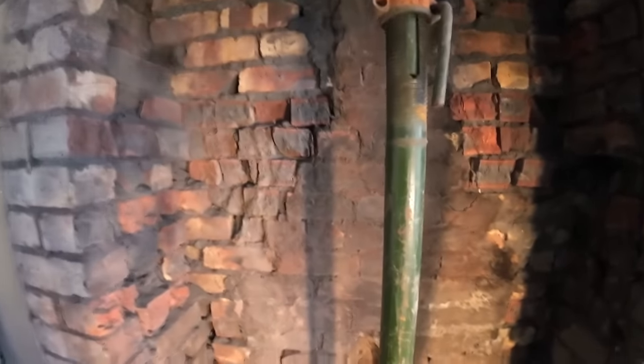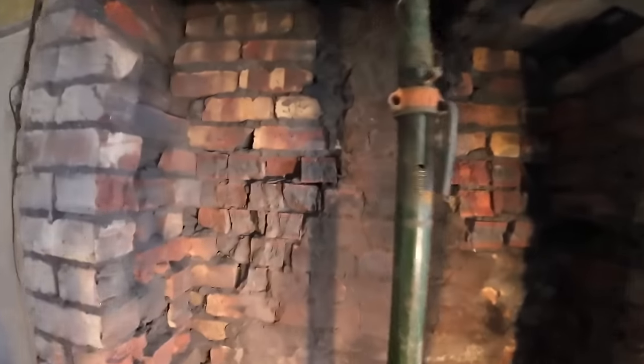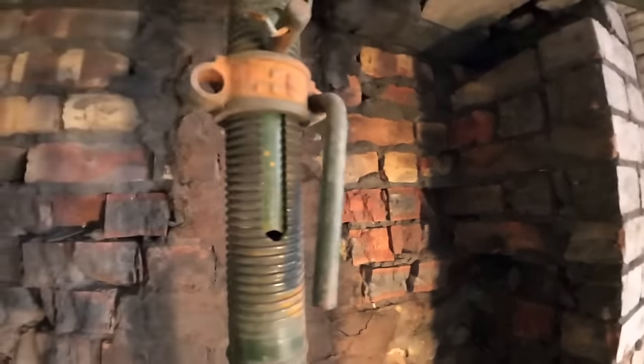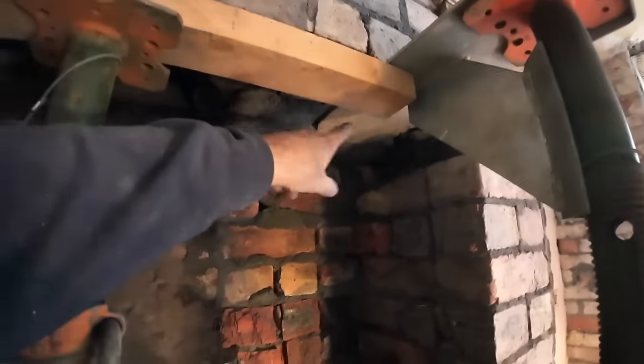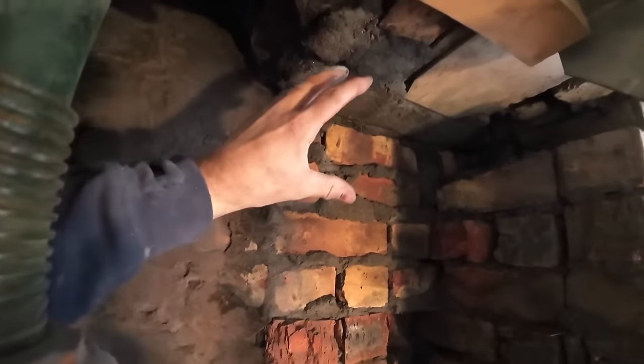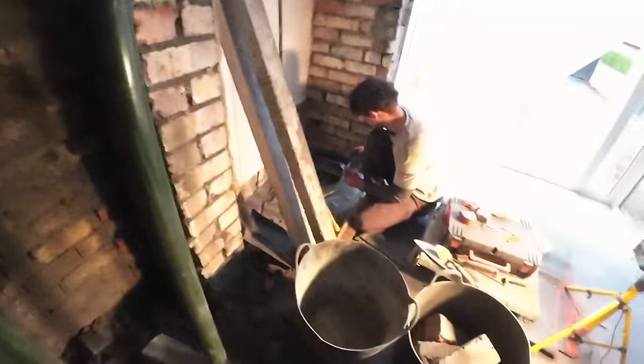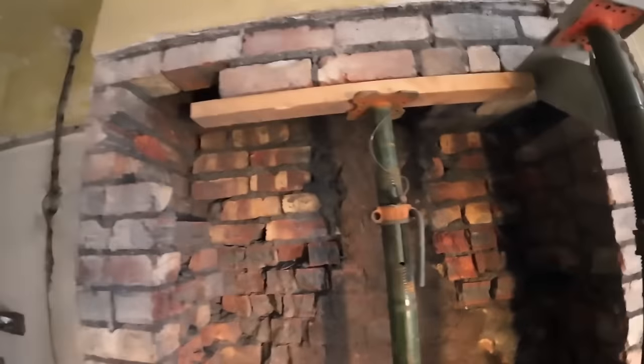A DIYer might think, what the hell am I going to do with that? And you've got to know that it's like that, so that you know to have it propped and what to do with it. That's worked in our favour, having it toothed in like that. That's a lot of strength, as you can see. So, that's a header, and we've got the header propped. And that's pretty solid anyway. It can't just fall down, it's too solid. So we're going to, as I said, tidy up, clear the decks, and get those three lintels in.